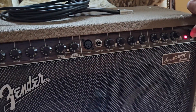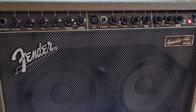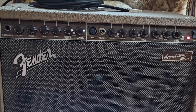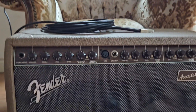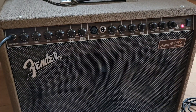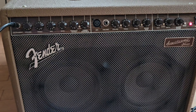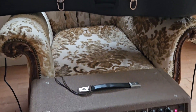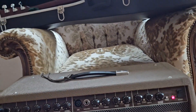I'm going to turn on the amp — I know it does have a bit of a noisy reverb. There's a low frequency 50 cycle hum, not particularly loud but noticeable when you turn the amp on. Next check is with the guitar plugged in. The hum level has increased very, very slightly, but nothing compared to before. I'm not holding the guitar or grounding the strings, because normally when you hold the guitar and ground the strings that noise will go away.